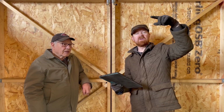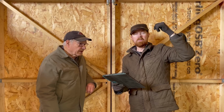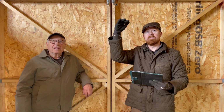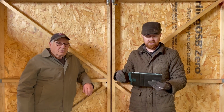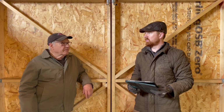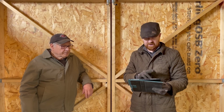So there'll be no problem with condensation because we'll put the insulation on the inside, and obviously that'll stop the heat running through and reaching the board at the top. And any damp that does run off the boards will run through the back of the weatherproof membrane into the gutter. We shouldn't get any condensation because there's a lot of stuff underneath the boards, and we've got it all worked out. We'll come to doing it. You'll see the boards have just got the weatherproof membrane to go on top of that, so that should stop us with condensation.